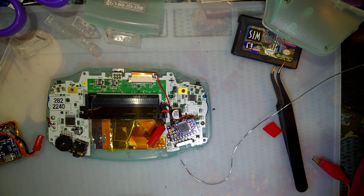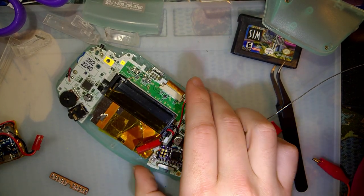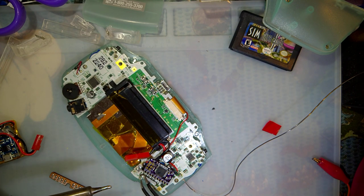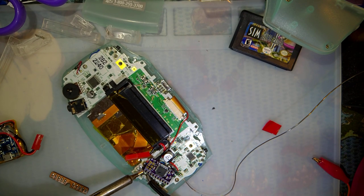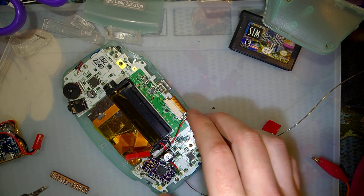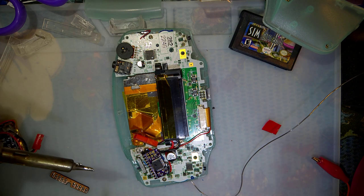Alright, so I actually figured out my error pretty quickly. I'm actually kind of embarrassed that I did what I did. This fuse is connected directly to the battery input, so it's always on. This line should be connected up to something that's only powered on when the Game Boy is on, which in this case we're going to use